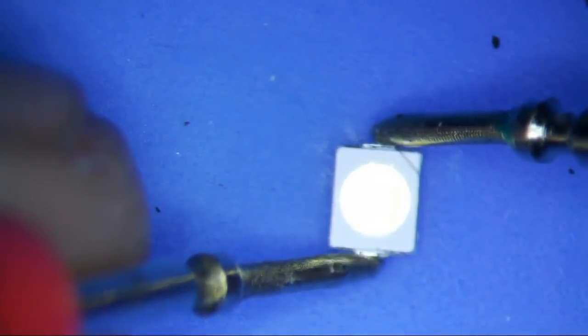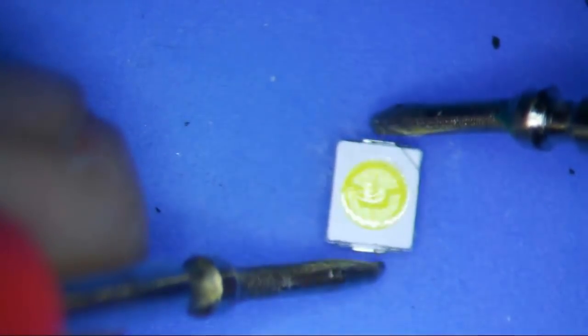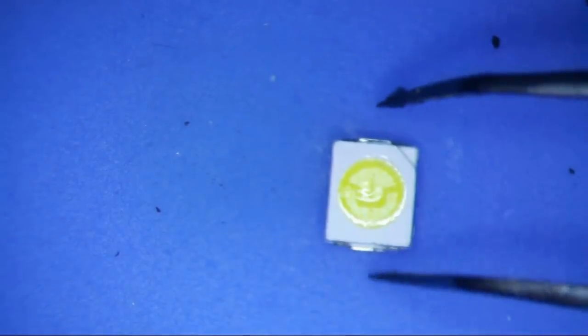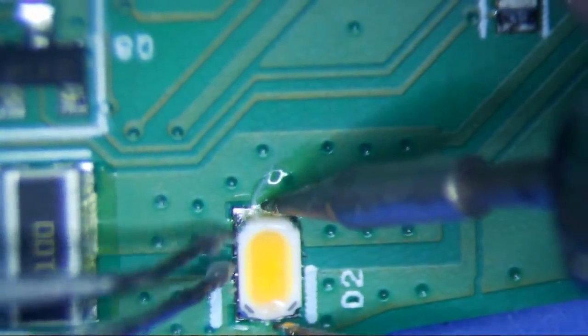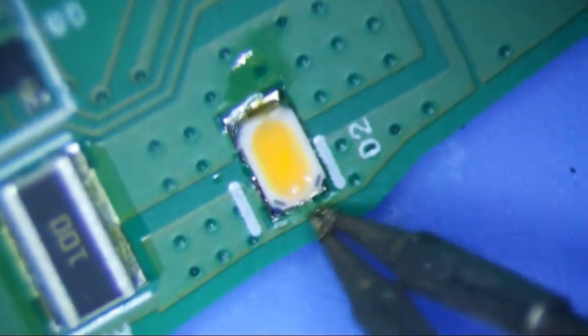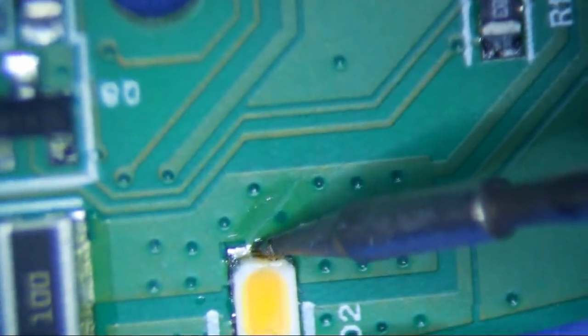As you can see, when you're using diode mode on your multimeter, it actually emits a voltage and measures the voltage drop. For the most part, I'm pretty sure that my Uni-T UT139C does about 3 volts. I think some of the Flukes do like 7 volts or something like that. I'm not exactly sure, but in diode mode, that wouldn't even make sense to me. But it's usually something around 3 volts, I think, because most modern diodes' drops are below that.